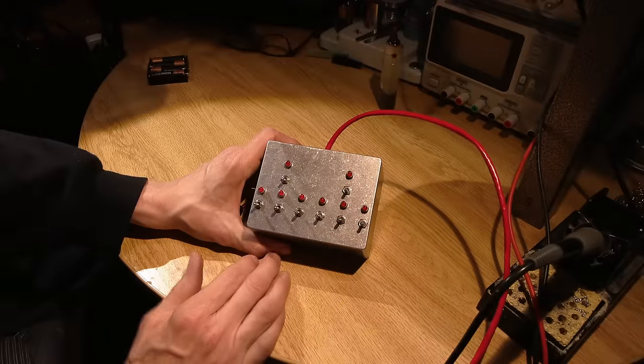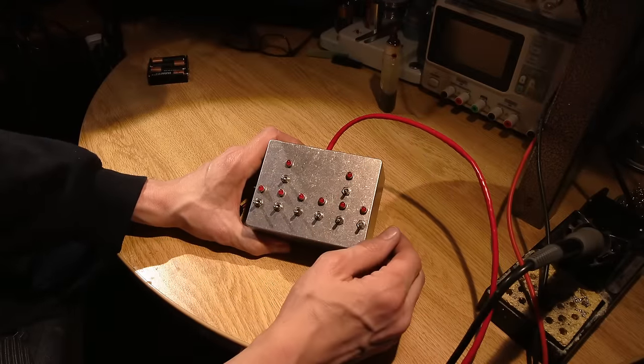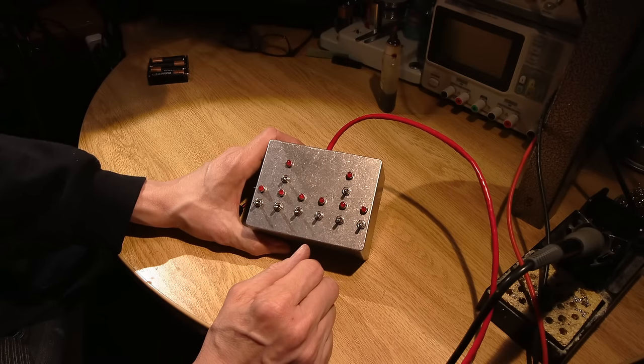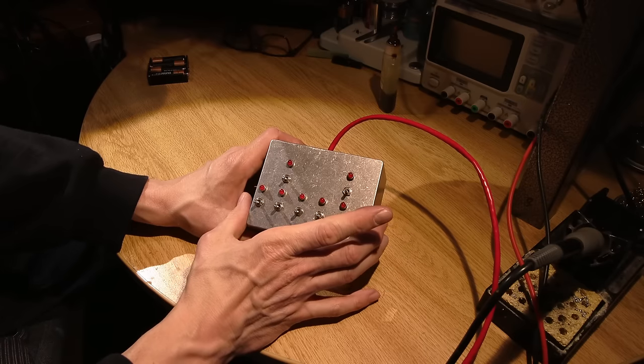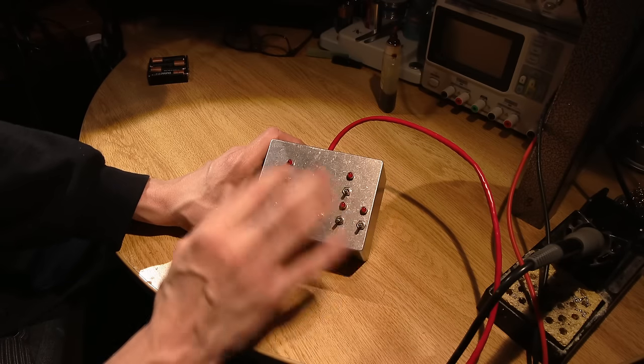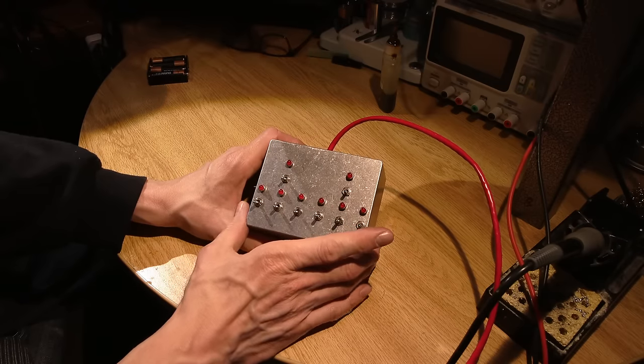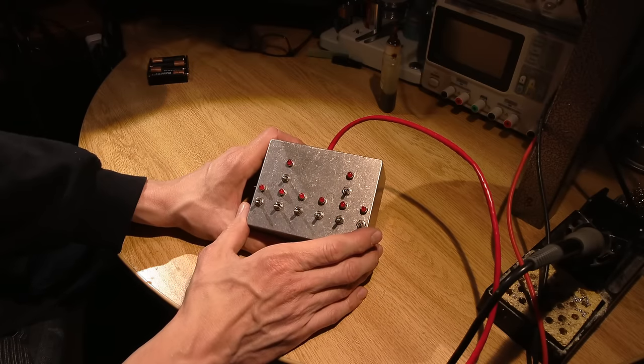The switch box is now complete. I used some Cat5e cable that will run down to the opto-isolator side of those solid state relays. So the box itself is completely isolated from this cable, from the switches, from the LEDs, from the battery, everything. So basically this box is floating, and I wanted that as one extra step of protection.